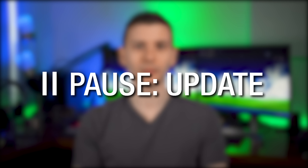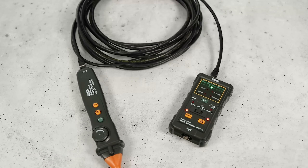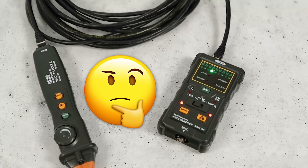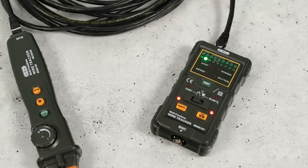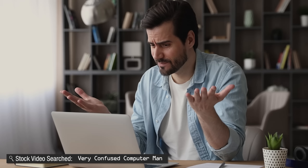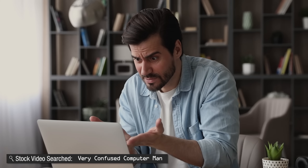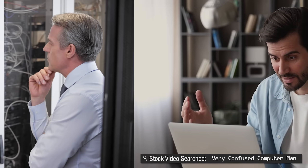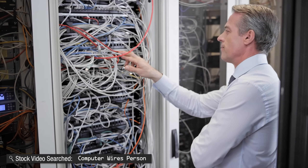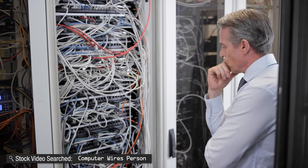Future me here — I have to jump in because as I was recording footage for this video, I could not get the cable tester to produce the split pair error again. I took the cable out from behind the desk where it was running before, and it wouldn't produce the error anymore. I believe the reason for the split pair was probably a false positive. I'm now thinking it was likely just radio interference, which would cause split pair-like problems. Specifically, this interference would come from other cables it was running next to before, but is not anymore, and also possibly from a cell tower very close to where I live.